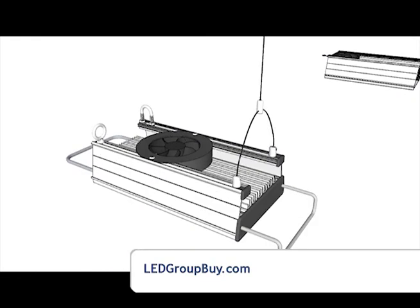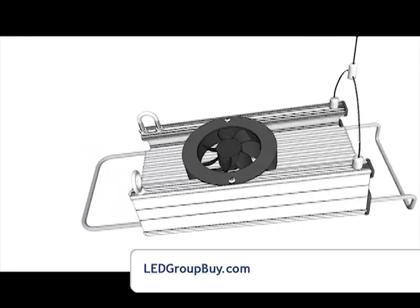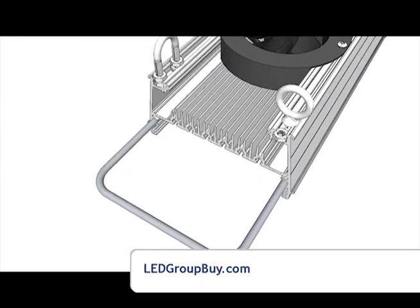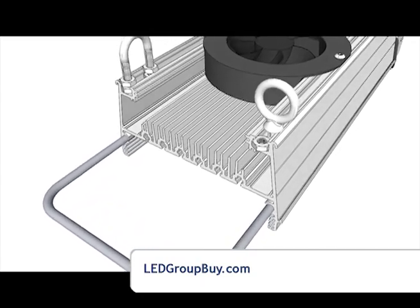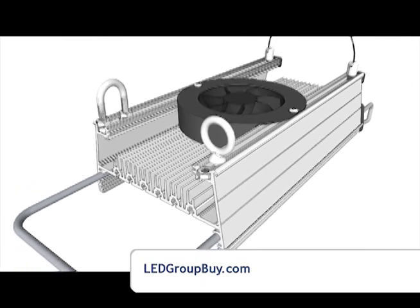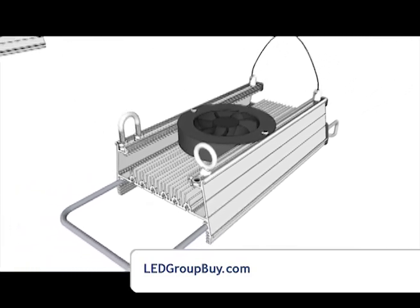Let's take a look at some of the mounting and hanging features of the fixture. In the ends of the fixture, it accepts a quarter inch dowel which facilitates hanging the fixture on two ledges of an aquarium. T-slots exist on the top of the fixture which accept U-bolts, I-bolts, pendant hooks, or just plain bolts.